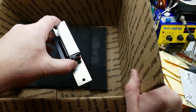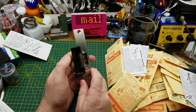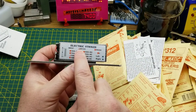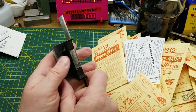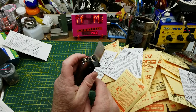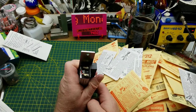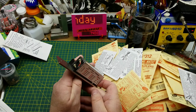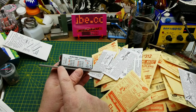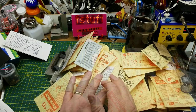The last thing in the box is an electronic solenoid striker for a door lock. You apply 12V DC to that coil and it will unlock this little door latch, so you can control it with basically anything — a swipe card, an electronic keypad, remote control, Wi-Fi through an Arduino — any number of things, as long as you can provide fairly high current at 12 volts.